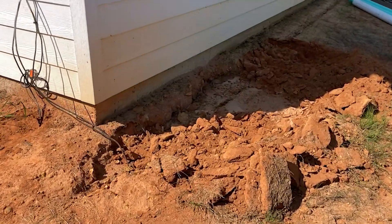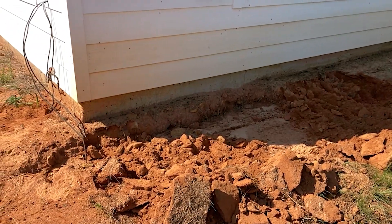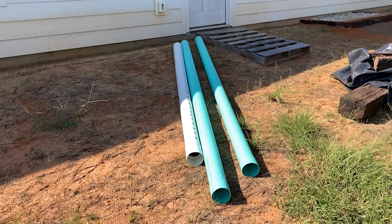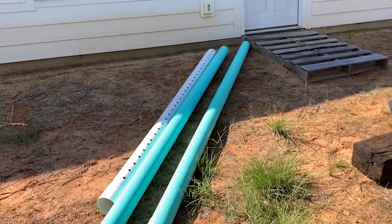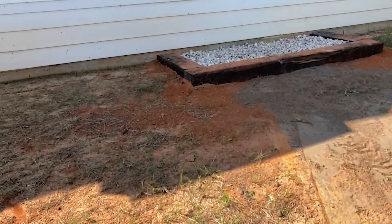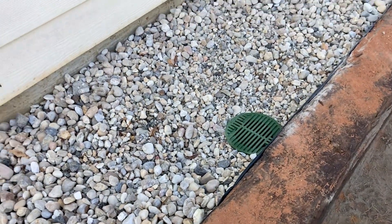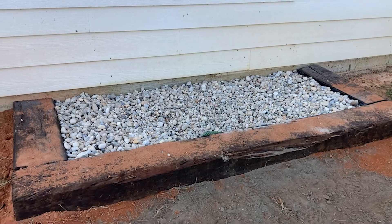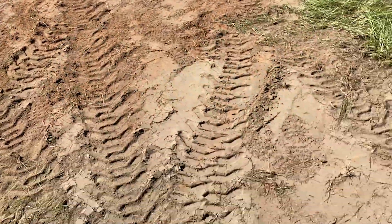In this video we're going to address this one. I broke this out yesterday with the excavator and I left a lot of shovel work, because I think by breaking out too much with the excavator I'm just going to have to backfill it. I've got the pipe — two 10-foot pieces and then a piece of perforated pipe that we'll put at the end by the pop-up — and I got the plastic and the railroad ties already pre-cut. This is what it'll look like when it's done: there's the basin in there, eight foot by 30 inches away from the foundation, and that pipe comes down here under this dirt.